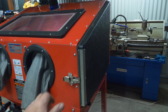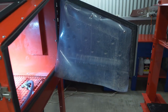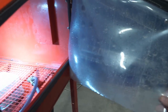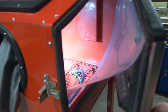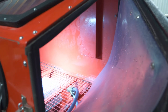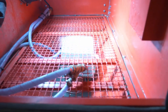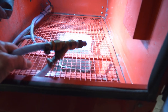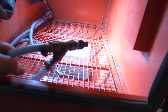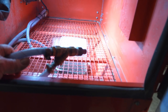Looking inside the cabinet — I'll just open the door. I've put a plastic shield on there, just clear plastic about 5mm thick, and it's working really well for keeping media build-up off the door. It's deflecting all that media and water back into the cabinet. I put extra foam around the entrance and this cabinet is not leaking any water or media at all. Inside you can see the pump and the nozzle. Our Kiwi friend has a very good video on how to make these nozzles so I suggest you go to Armory Enterprises — I made one following his instructions and it's working really well.